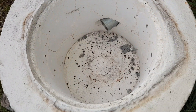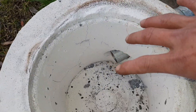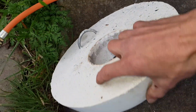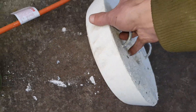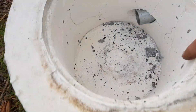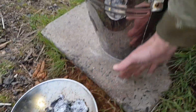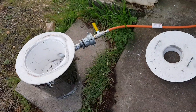So here's my foundry - plaster of Paris with a bit of sand, 50-50 mix. Put it in one bucket, stick another bucket in it to make the hole, drill a hole through for your heat source or air blower. There's some dross off the last melt in there. The lid was just cast in another bucket. Those little bits of metal in there are stainless steel, like steel wool - basically just to act like reo within the plaster and sand mix to hold it together. Same with this - there's rows of chicken wire around there. The base is quite thick and reinforced with wire.